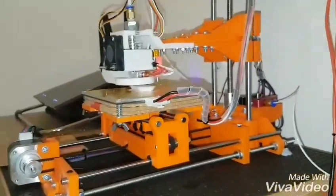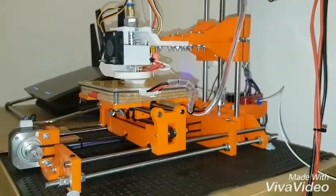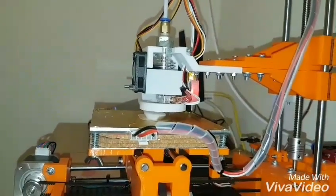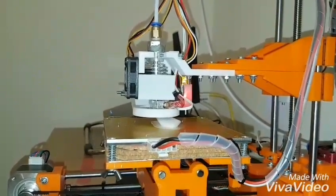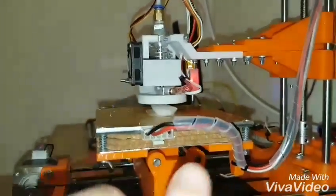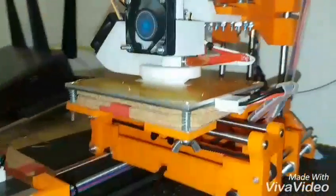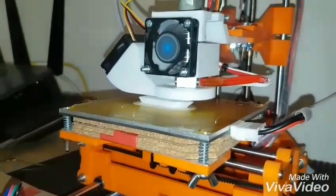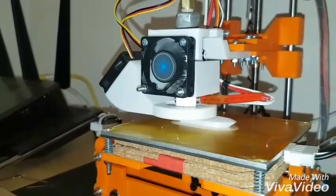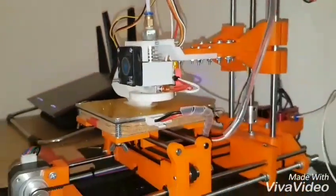Just a couple of points — I have linked all my parts here. I put them on Thingiverse and put them in the other video. If you want to do this with a BLTouch, I can put a config up on the Google Groups. If you want to use my way of doing it: 33mm behind on the Y and nothing on the X and the Z, with a minus 0.62 offset on the Z. I'll link that in the description.